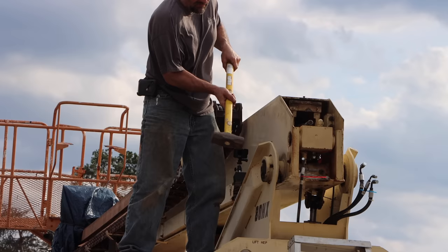Well, I just broke my mag drill. I wish I had had the camera rolling. I think it was my fault, just because there isn't room. The magnet wasn't fully engaged, the bit caught, the magnet ripped off, and it spun around, hit this, and just ripped this off of the drill.